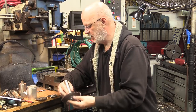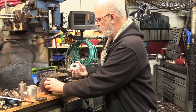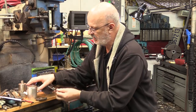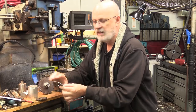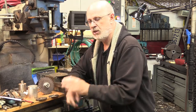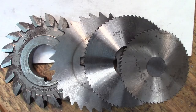So teeth size according to material matters. If you're trying to use a blade with very tiny teeth in aluminum, try not to go for deep cuts because aluminum will pack up very easily in those little saws. You're better off using saws with bigger teeth, and there are assortments of those available.